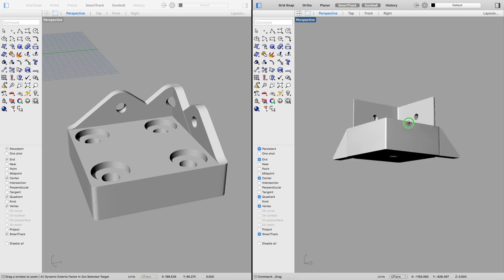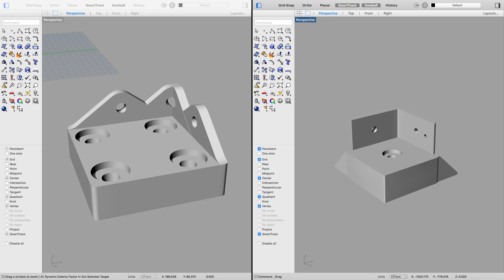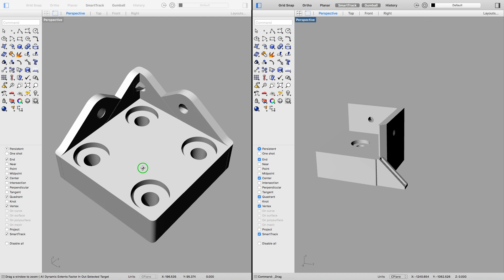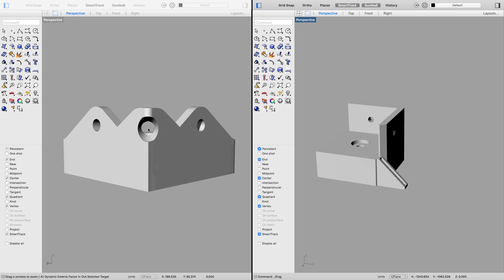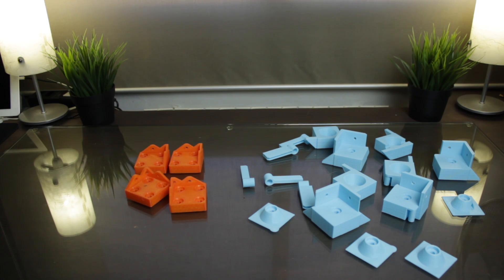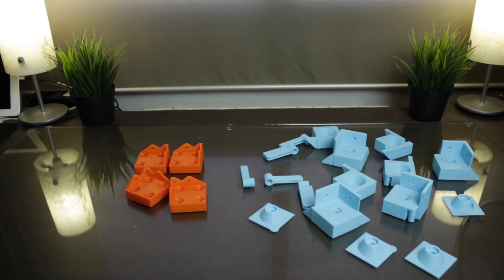The parts designed by Prusa were not optimal because they only used a single screw to hold it with the top of the table and two screws to attach the leg. In the Architects 3DP design, it uses four screws to attach it to the top of the table and three to attach the legs to the printed part. Since I don't need to make an enclosure, in my design you only need to print four corners to attach two tables, instead of the six pieces needed for Prusa's design.